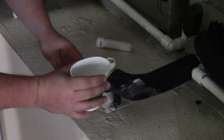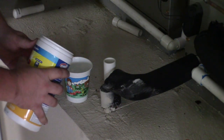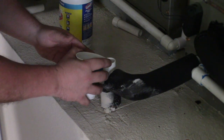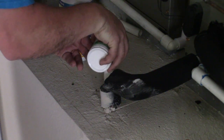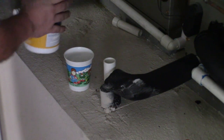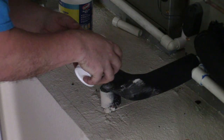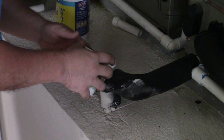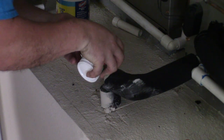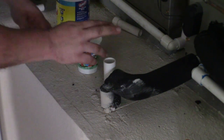I've got a little flexible cup that I like to use so I can pour it down nice and easily. You can put a funnel up here if you want to. I'm just slowly feeding water down the drain. You can hear the pitch change when you dump the water in — I can still hear the vacuum going. We've dumped water through this three times from a little cup. The sound has calmed down, so we're going back outside now to actually turn the vacuum off.